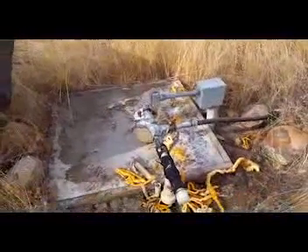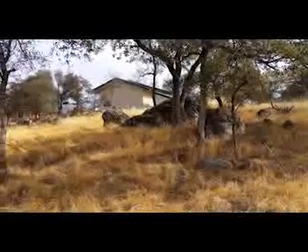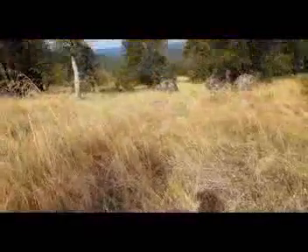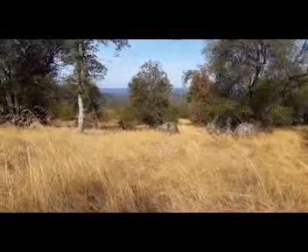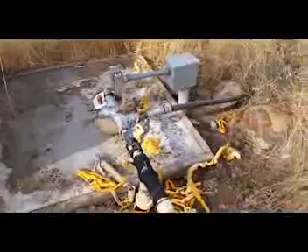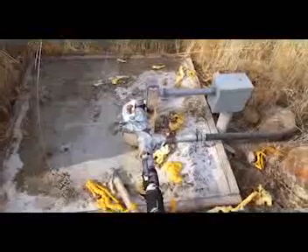This pump right here is the SQF 11, feeding all the way back from our building up there. I'm running right now 8 panels of 175 watts on this pump, which is a good amount — it's running at upper 100% and putting out a solid 11 gallons a minute. They've got it piped with poly pipe running down a hill to a nice pond that they've got some bass in, trying to keep that thing going so the fish can stay alive through the summertime. It gets some nice water and stays full pretty much off seasonal rain. These Grundfos pumps are amazing — I've got a lot of them out there, including my own house where I'm running the 6 gallon a minute version. They draw very little power. I also noticed some mice living underneath this big fake rock, so I'll have to do a little something with that next.